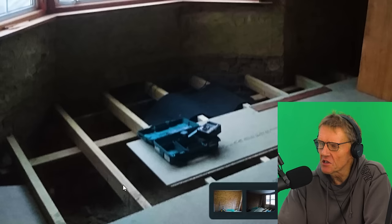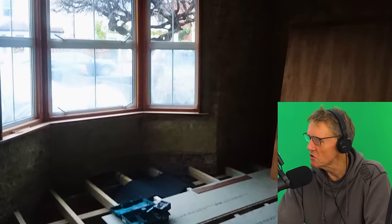Put the boards down with a nice bead of adhesive all the way along the joists, and also glue the tongue and groove joints. Expanding glue in a bottle is made for this job, and if you do that it won't squeak. A lot of people don't bother gluing the joints and later get squeaking as the boards shrink and move slightly. By the time you've done all the work, it's difficult to rectify.